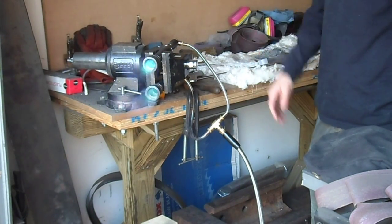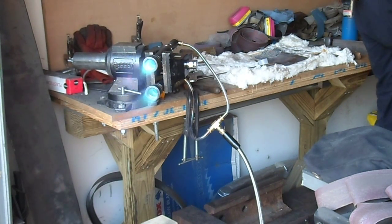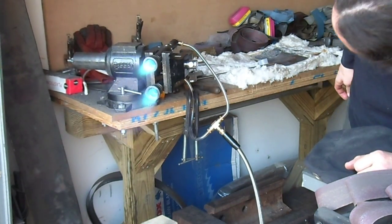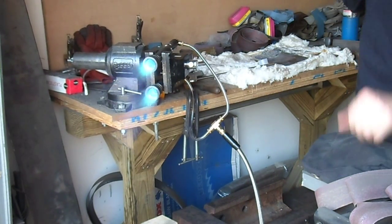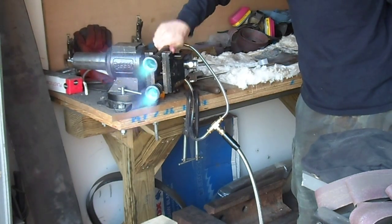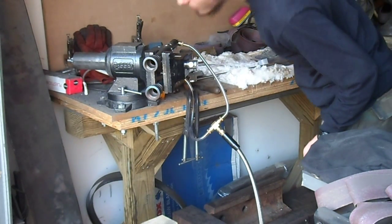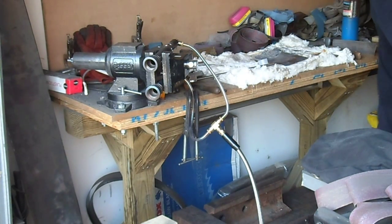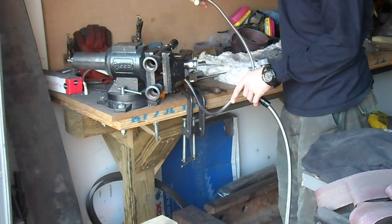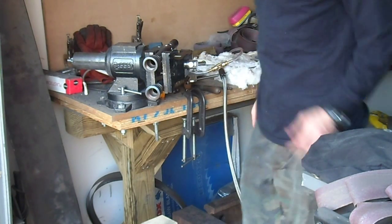As they're burning right now, it's a little bit less pressure than I'd probably use if I actually were firing them in the forge, but I'd probably crank them up a little more like that. Everything seems to work pretty well in these new assemblies — it's basically just a new way I'm assembling the actual gas-blowing assemblies here. The torch bodies and the torch flares are still the same because those work fine and I was pretty happy with them.